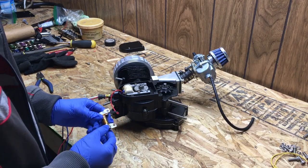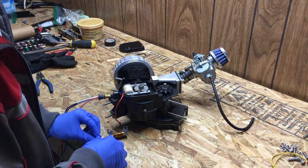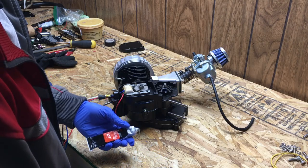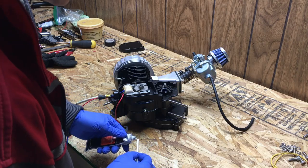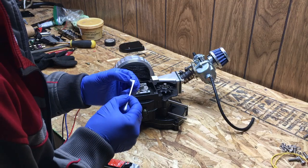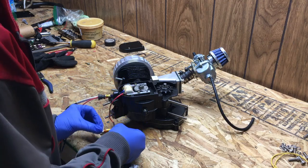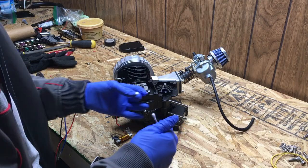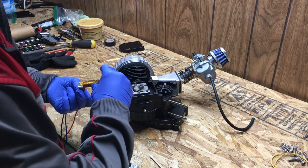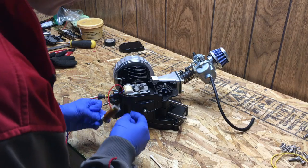Now that we've got our tabs cut to size, we're going to go ahead and glue on these insulators that fell off — they just didn't use a very high quality adhesive, and that's what happens when you don't. We've got some 3M plastic emblem adhesive, which is very, very sticky and very smelly. You do not want to get this on your skin — it takes forever to come off and it burns. That is the reason for the gloves here. Now we're just going to make sure those are lined up and give it about five minutes to set up before we put it back in.